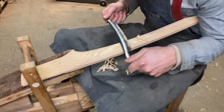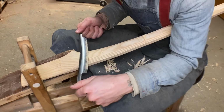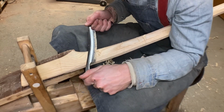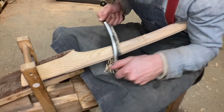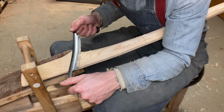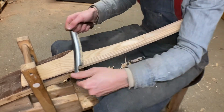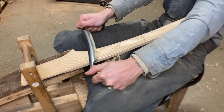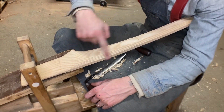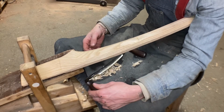Got a change in the grain direction there, going from one layer to the next. You notice I work with a lot of facets, right? So we have this facet, and this facet, all these different faces of wood that are actually flat. I like doing that to get the general shape, and then I knock my edges down, whether that be with the drawknife or with a sander.